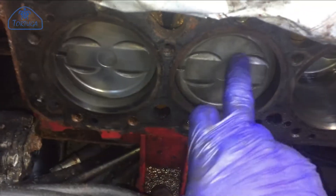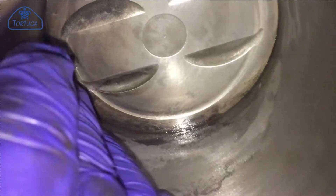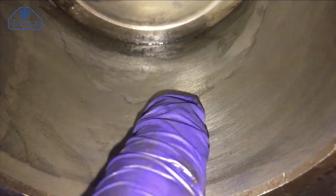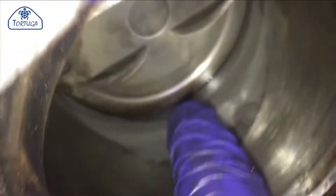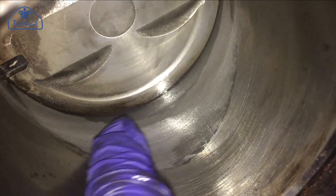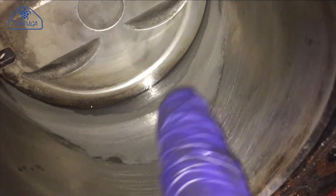Just using a little brake cleaner across the pistons and the crowns themselves. You can see I've brought it up really nicely. There's still a tiny little scar there, but I can't feel it. And likewise, back here — this is cylinder 7. You can see the mark, but you can't actually feel it. It looks good.